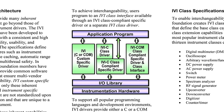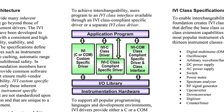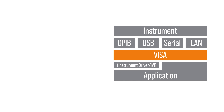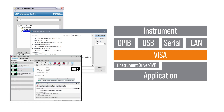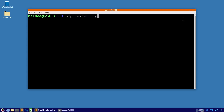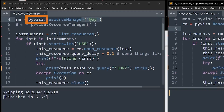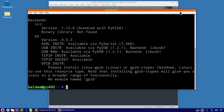You might also hear of IVI, which is another API known as Interchangeable Virtual Instruments. It mostly replaced a really old standard called VXI, but in general it uses the VISA driver to also send SCPI commands. To talk to instruments, the computer needs a VISA driver. VISA drivers are available from several test and measurement manufacturers including NI, Rohde & Schwarz, and Keysight, plus a few others. However, make sure you read the licensing terms very carefully. My interpretation of at least one license says you cannot use their VISA software unless you use their popular automation software, some of their hardware, or pay a $700 licensing fee. For that reason, in this video I am using an open-source VISA driver called pyvisa-py. So to be clear, I am using the Python module PyVisa as a wrapper to the VISA driver called pyvisa-py. You can tell PyVisa which VISA driver to use if you have multiple installed.